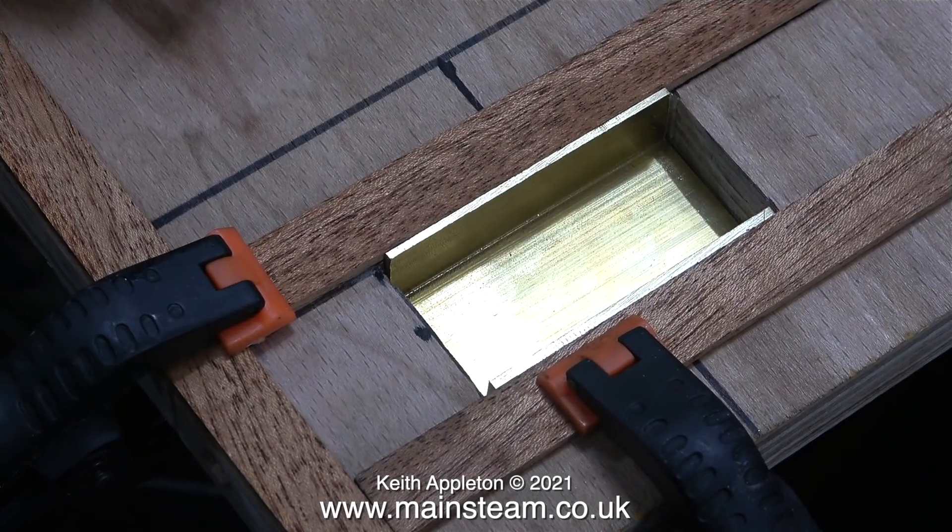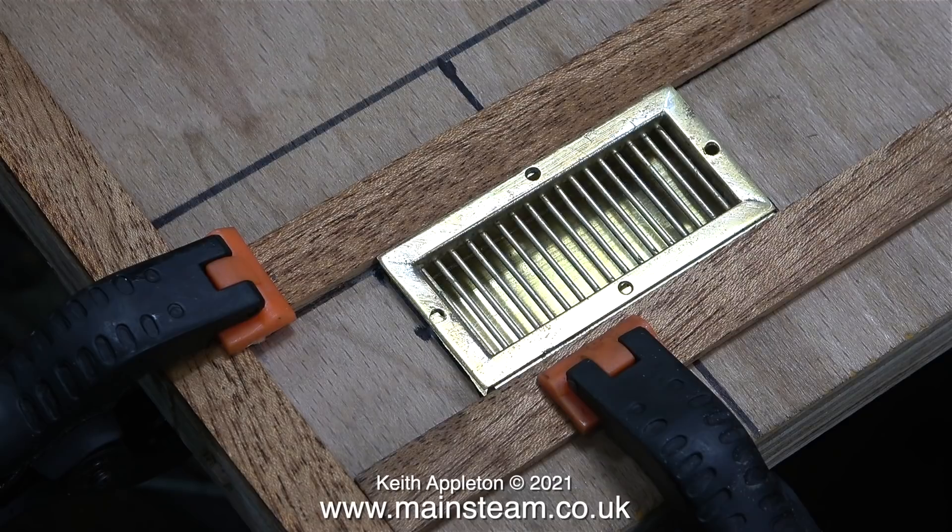When I turn the baseboard over you will see that the cut piece of box section sticks up level with the top of the planks. I need to do a bit of silver soldering to turn this piece of brass box section into a complete finished sump, which will also support the top grating. In the previous version I was going to screw the grill to the mahogany, but I didn't think that was a good idea. Apart from silver soldering some ends on the box section, I will also thicken the sides so I can drill some mounting holes for the grate in my fabrication that's yet to come. And that's it for this episode - stay well, thanks for watching, and I hope you found it useful.